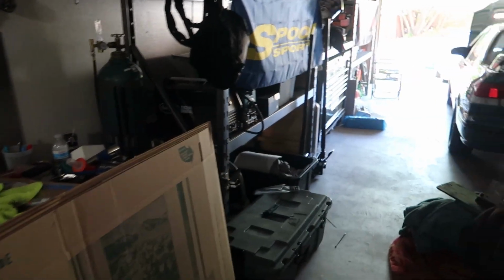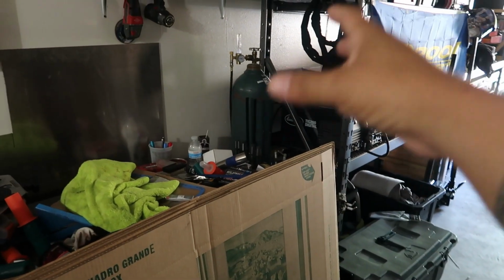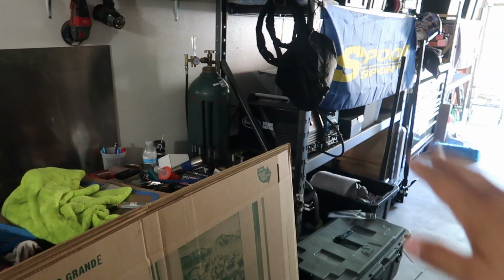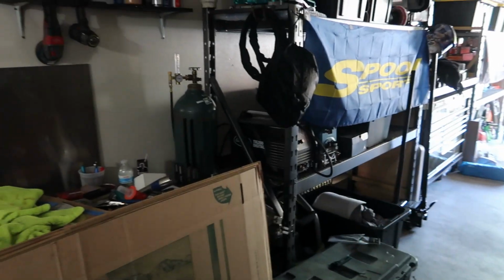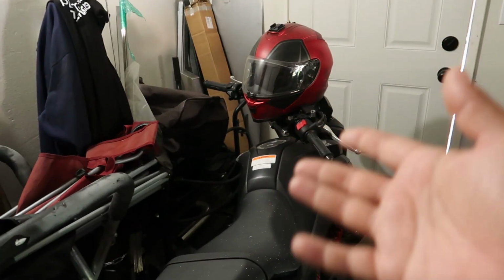I need to get bigger wire because this wire here is not enough. I mean, I can use that and run an extension cord from wherever to wherever, right? But I would rather have that wire come all the way from the junction box, routed up on top, and that way it has its own special spot right there, and that's where it stays. I will buy a bigger extension cord later on, to fit the box, so I can use it for the welder, because that is more mobile.